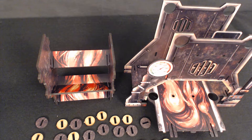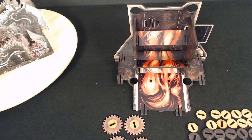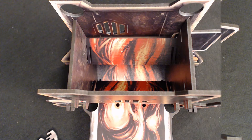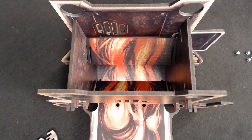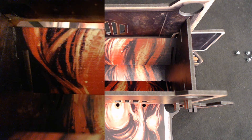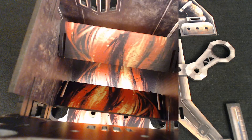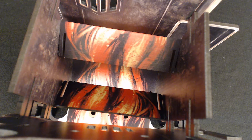With all three baffles in place across the two boards, you almost have a complete baffle box. You'll need to fit this into the front and rear pieces of the tower, but don't fit them all the way in — leave that for now. In this part of the construction, I add the front and rear tower sections to the floor and click those carefully into place. You're looking to add the rear to the floor, then place the baffle box in there, followed by the front securing everything. You can't fit that into one solid construction at this stage — you still need wiggle room to add the trapdoors later.